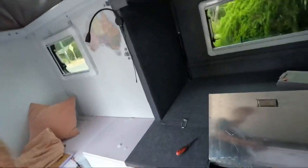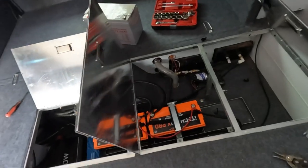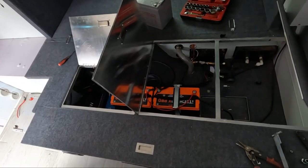So we've put them in — and that's it. That's an install! These 120X Pro batteries are a 12.8 volt version but they're just a drop-in, drop-out replacement for AGM, lead acid, or whatever you've got. You don't need to change any chargers, don't have to change anything with your solar — you just put them in. It probably took me a little bit longer because I was filming, but you could realistically do this in 15 minutes and have your old AGM battery setup changed to lithium, double the power, less than half the weight. It's as simple as unscrewing your terminals, putting the new one in, and putting it back.